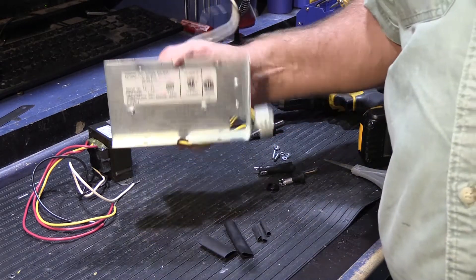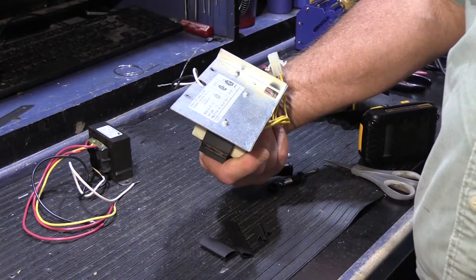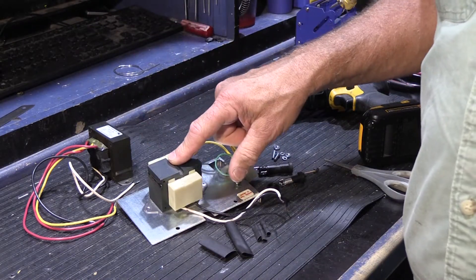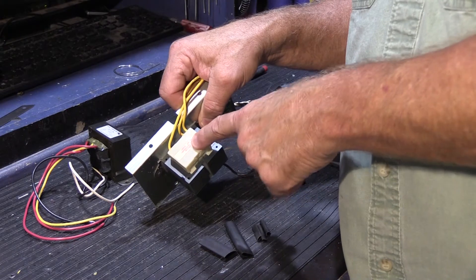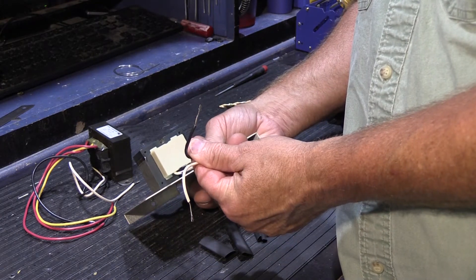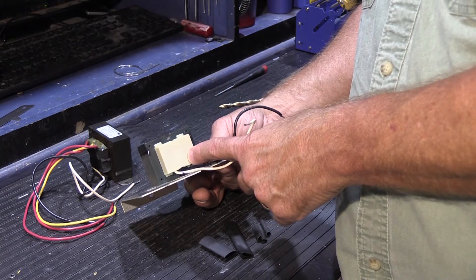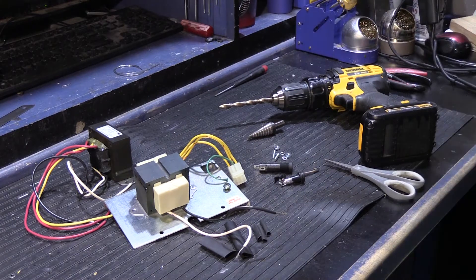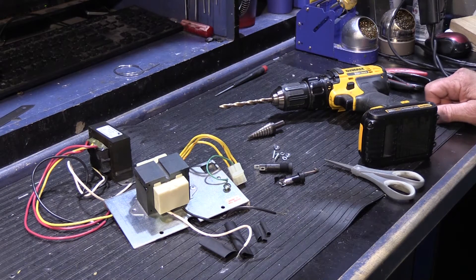They sent it to me. This is not available from Music and Sound anymore, and a really thorough search online couldn't find anyone that has any left. This transformer is from about 1994, so it's about 16 years old. When she sent it to me and I opened it up to check the fuse on the secondary side, the fuse was indeed blown. But I also discovered that the primary side — the 110-volt side that wires into the house electrical circuit — the windings are open. There's a break; the primary side is dead. This transformer is unrepairable. The only option is to replace it, and if you can't just find one to buy, you have to do something more than that, and that's what we're going to do today.